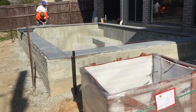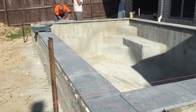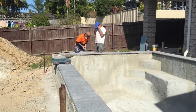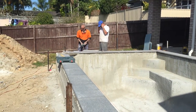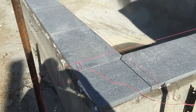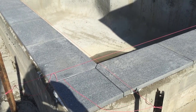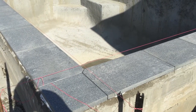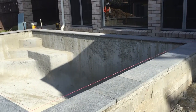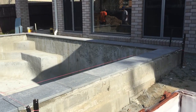At the moment we're putting the coping around the pool. This is Shane Askew, one of the top leading professionals in the industry with pool coping. You can see here that we have the string lines to get the top of the pool and the pavement perfectly true at a perfect 90-degree angle at each corner.